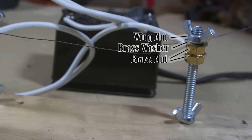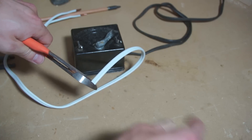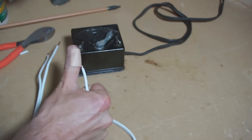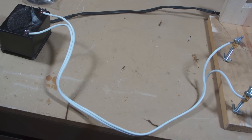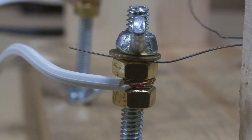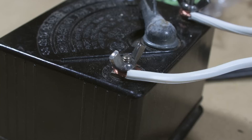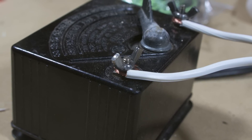I'm using brass because it conducts electricity well. Next, I took a cable from a $2 extension cord, cut out a 12-inch section, and used wire strippers to expose a little bit of copper on each wire. Without too much effort, you can also use a razor blade or scissors to strip the insulation. Put one wire around a bolt and sandwich it between the two brass nuts. Do the same with the opposite wire. Then, with the power cord unplugged, sandwich the other ends of the two wires on the transformer terminals.